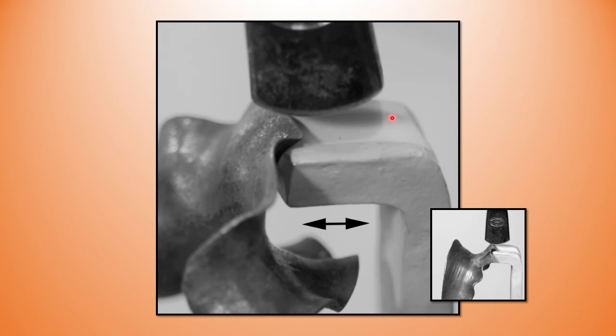When you make the crimping stake, again there's a half-inch diameter groove at the top, and I want you to give enough room in the neck so that you can swing the leaf backwards and forwards. What I'm about to do in this photograph is flare that edge, and in order to flare the edge inwards I have to swing this leaf, so you want the clearance there — don't make these too small. I also want to be able to hold this leaf vertically as I flare from the inside going outside, so they need to be deep enough and tall enough so you can work without interference.